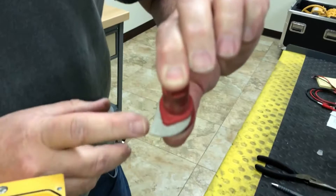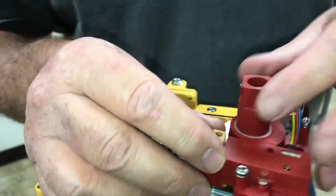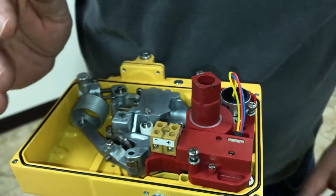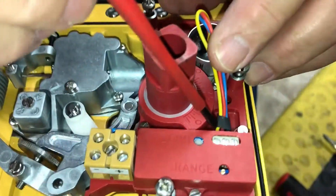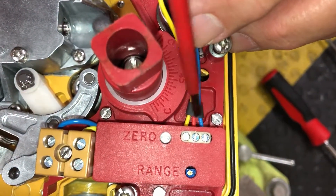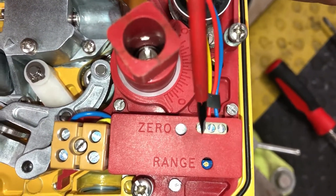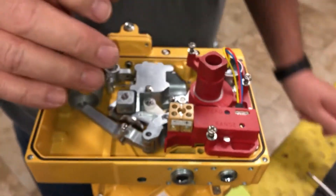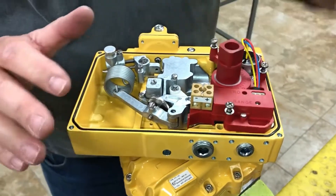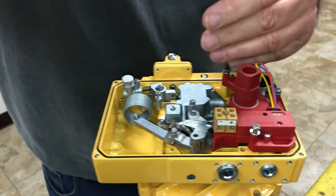That's the way we're going to set it up today — just like that. Also, if you go clockwise, you also need to change these wires here: switch the blue and the yellow wire, so the yellow wire will be on this side and the blue wire right here. That way it's all ready for clockwise. So once again, we're just doing it all anti-clockwise today.